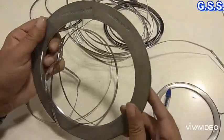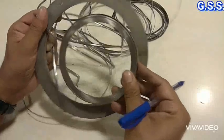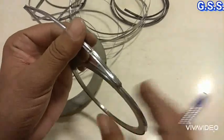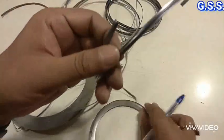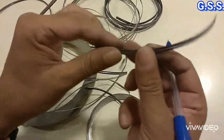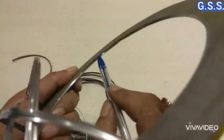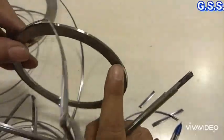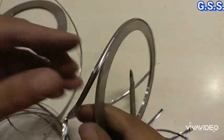This is one failed gasket. This is the outer ring, and this is the metal winding. The metal winding has a curvature like this. The metal winding is having a groove, and the inner ring is having a curvature outside. The metal winding sits over the ring like this.